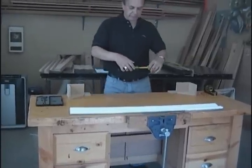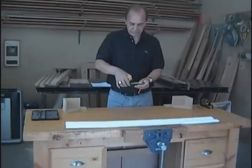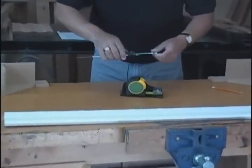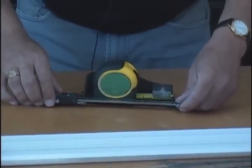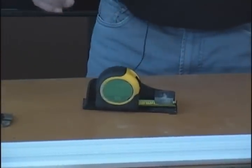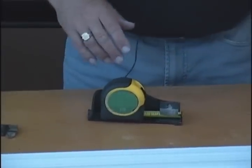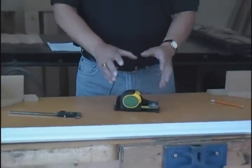To calibrate the tape gauge, set the crosshair to one inch, which corresponds to an inside measurement of six inches, then use a digital caliper to check the calibration of the gauge. In this example we're accurate to within about five thousandths of an inch. If adjustment is needed, insert the wrench and adjust the screw inward or outward depending on the result from the caliper, allowing you to calibrate the tape gauge to within thousandths of an inch.